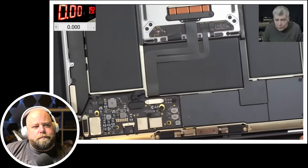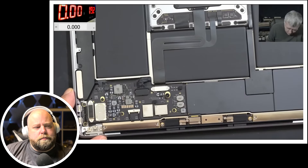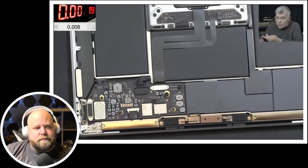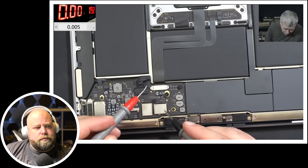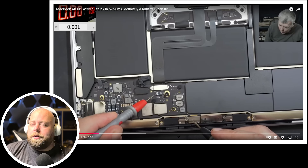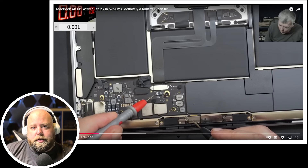Nice small motherboard and it's looking good — no liquid damage, no signs of prior work, and no fingerprints. Let's plug the charger and do some checks before pulling out the schematic. For MacBooks we can find schematics, so that won't be a problem. He's using his multimeter with the red probe on the data lines and black probe on ground, testing voltage. He's checking different rails to see if he can detect a problematic area — if you understand the voltages for different lines, this is an easy way to identify a failure on a particular line.